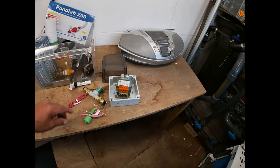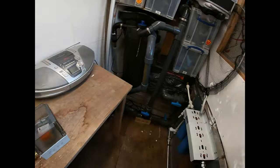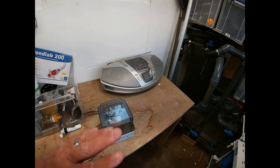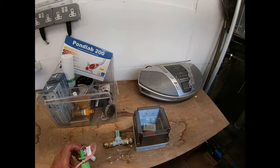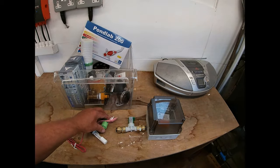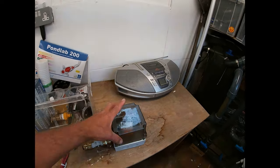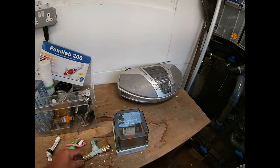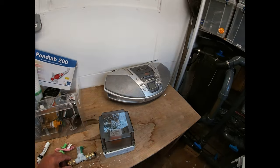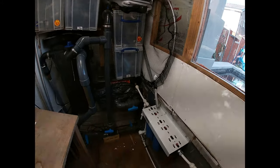This is the next project — a little upgrade on the ball cock system, because sometimes the ball can stick. We've got a plunger type float level that will basically connect via a contactor and allow a solenoid valve so that'll fit in there and replace the existing system.